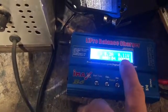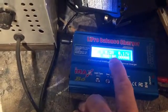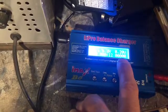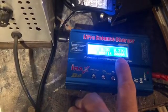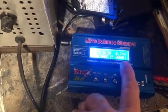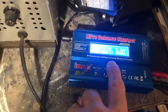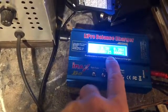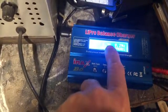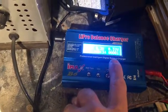It's at like zero point something and it's going up slowly — it's charging at two tenths of an amp right now, just to warm it up, and it's actually taking a charge. It reads 0.22 volts and it'll work up. This here is your time, and this is how many milliamps have gone in — one milliamp so far. When this gets to two minutes it'll bump up to two amps instead of 0.2 amps.